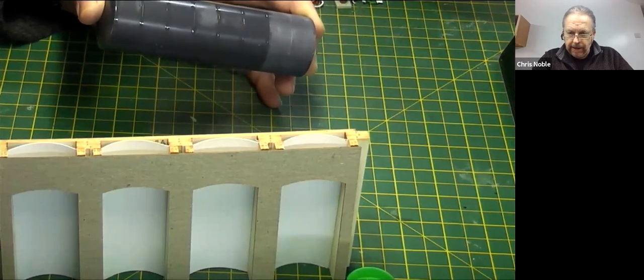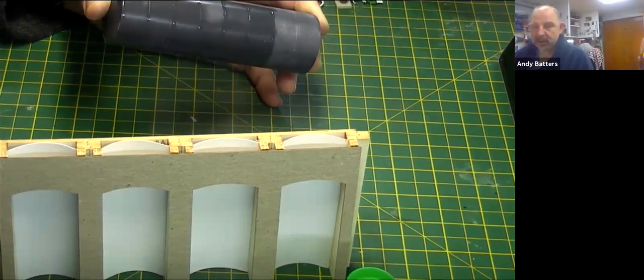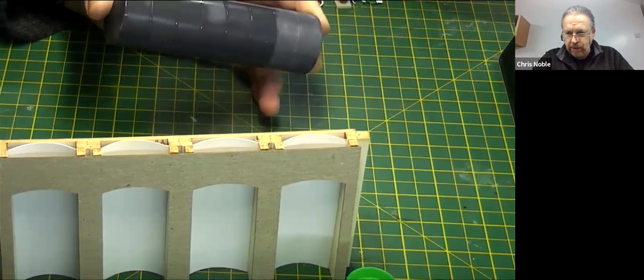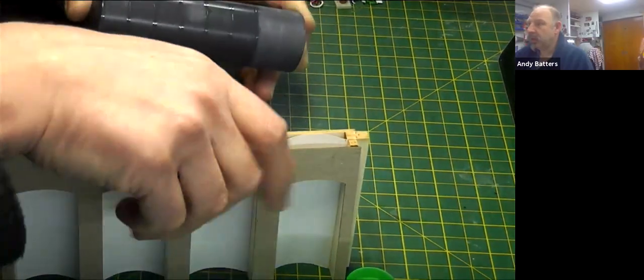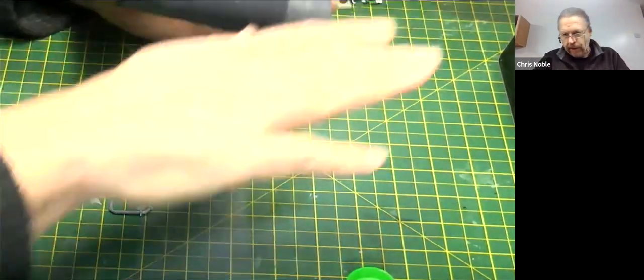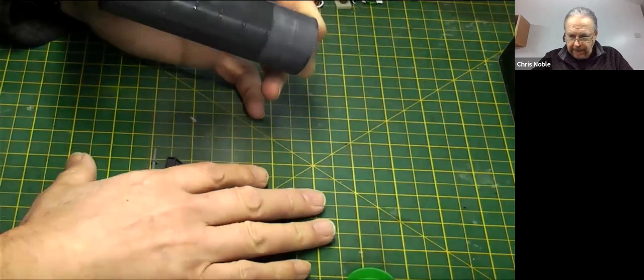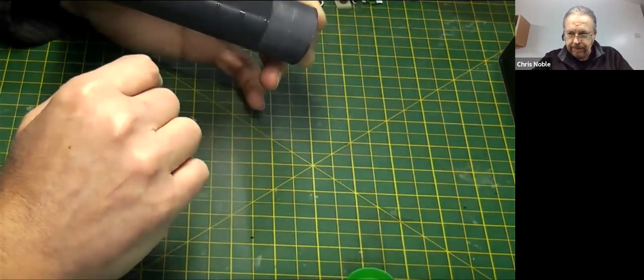You can make those yourself. You just get a piece of timber, a bit of ply or something like that, a thin ply, and then stick nails in at a spacing of about 25 mil on a grid. Like a bed of nails, right? Yeah. Then you put your material on top of the bed of nails, and when the laser cuts through it, you don't get any scorch marks underneath.